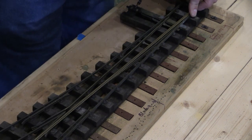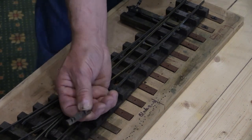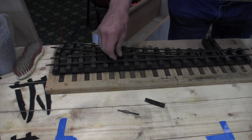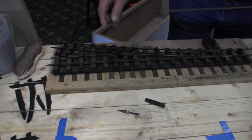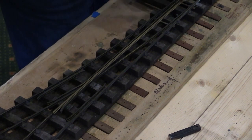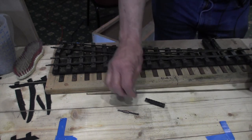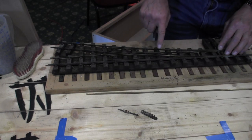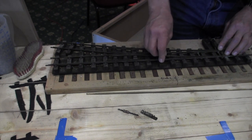I have another jig to hold that distance. Again, it's another piece of square bar with slots in, and they're designed to hold the check rails at the correct distance and spacing. So that end is slightly cranked round. This end, again, you file to a point to fit into the notch. There are four standard chairs there, which again, use your drill jig to drill them.